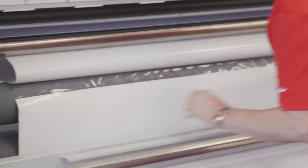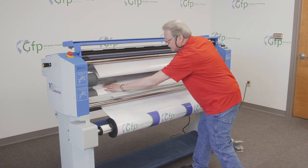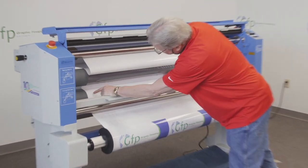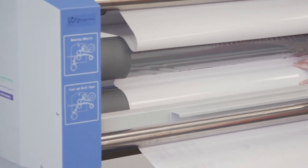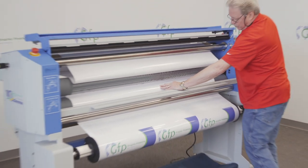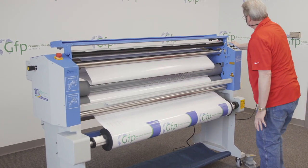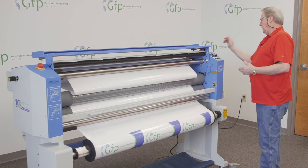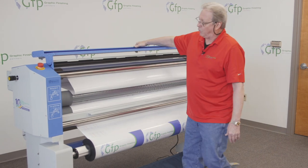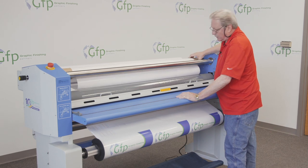Now I want to give myself a little bit of slack and push this in. I'm looking to make sure that the film and the media are nice and flat, flush to the rollers on the top and the bottom. Once I see that, I'll hold it in place and bring that top roller down. When I feel the top roller touch the bottom roller, I note the position of this handle on my hand wheel and go one number on the face of a clock. Then I'll lower my feed tray and take up my excess on my release liner.